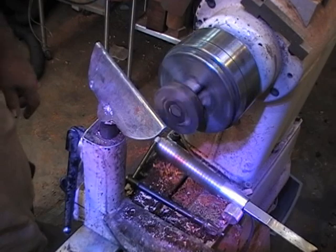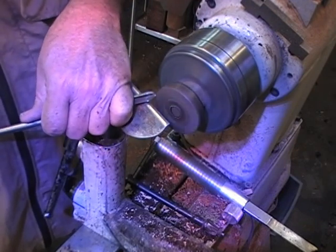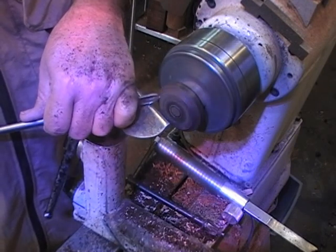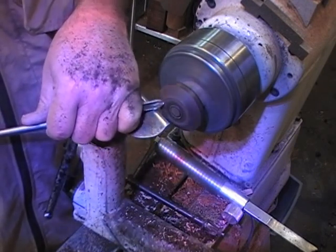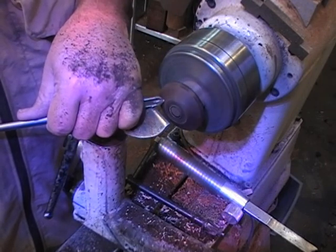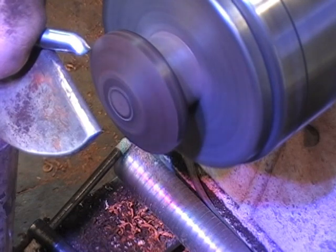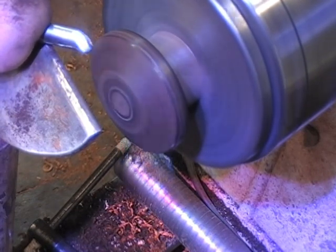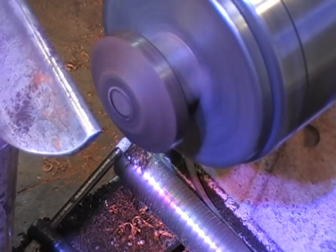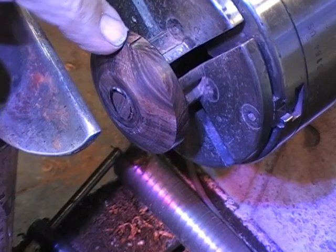So we crank it back up again. Hard dense wood like this, we're going to spin up real high in order to make the cuts. We're going to go negative — read a bevel — slice on through. I had that saw cut in there, so I've got to see if it cut. Nope, it didn't go away yet; I need to get another sixteenth out or remediate that somehow. But for this piece, let's get rid of it.